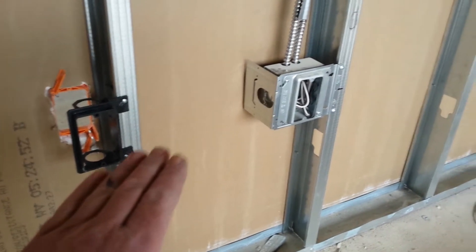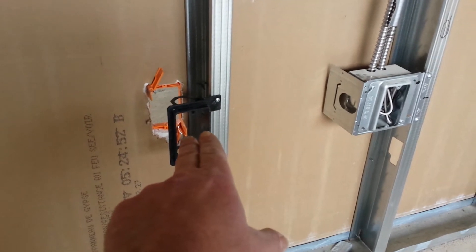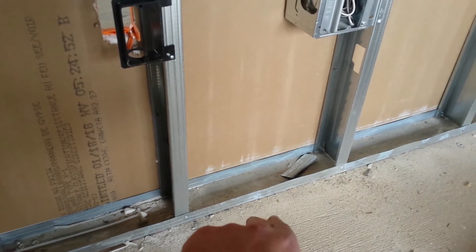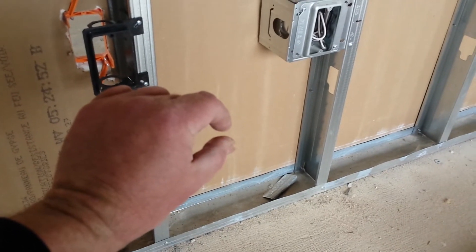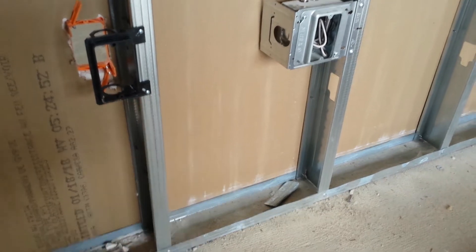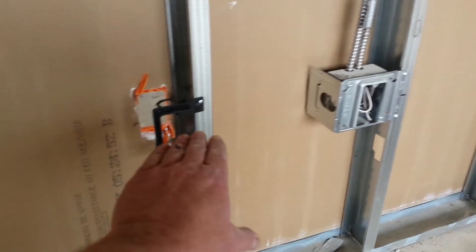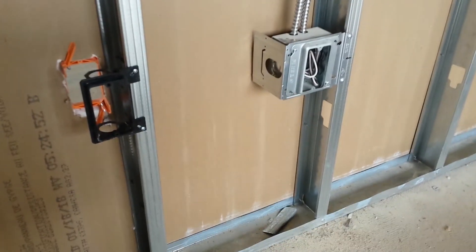Before we do anything you'll have to take measurements — 18 inches center. An easy thing to do is follow the electricians, since 18 inches center is typically standard, though it can vary. You also have to account for what kind of floor they're going to put on, so talk to the general contractor and make sure you're aware of how thick the floor is actually going to be. You can also just look at the electricians' boxes and go from that.